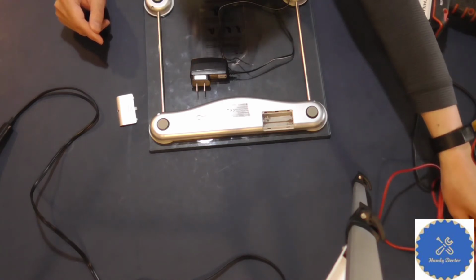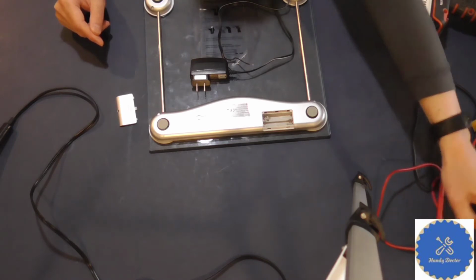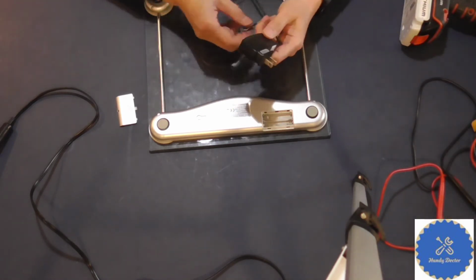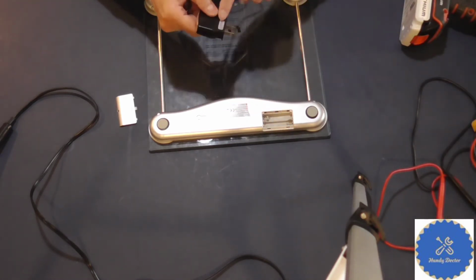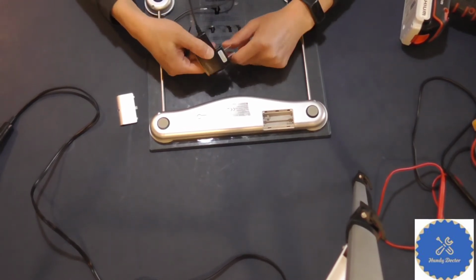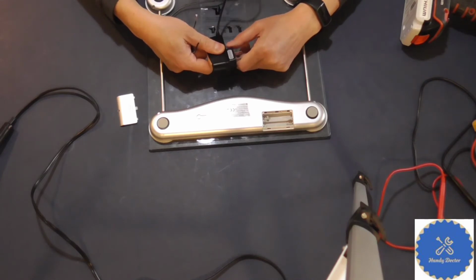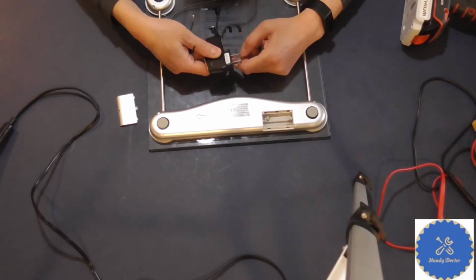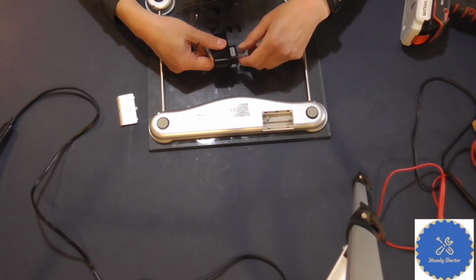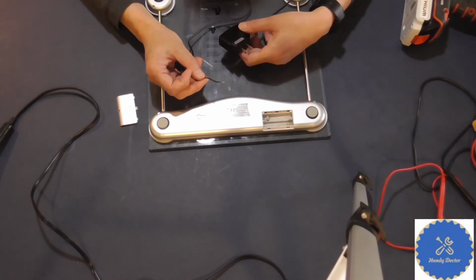It doesn't have to be exactly 3 volts, but probably as close as possible. But sometimes you may get surprised. Okay, I have AC adapters, and you can look at them and see the voltage. This one, the font is very small, you probably couldn't see it. I have some that supposedly are 3 volts, but when I measure them, they are way bigger than 3 volts. So usually, no matter what, you want to confirm it.